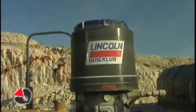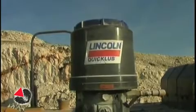The centralized greasing system enables the sliding parts to remain lubricated even when the breaker is operating horizontally, thus reducing wear and tear on components and extending product lifetime.